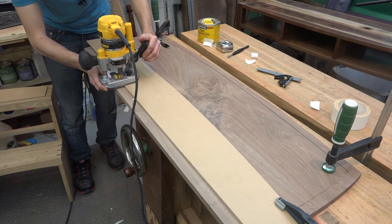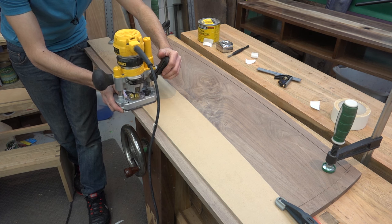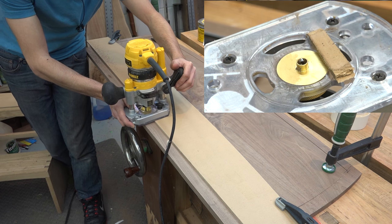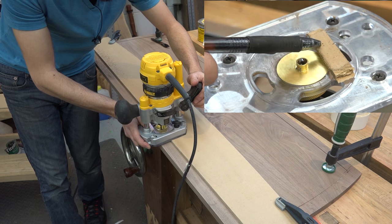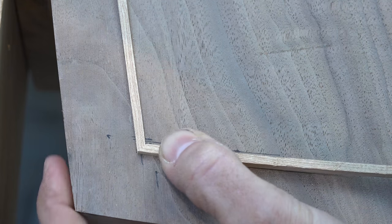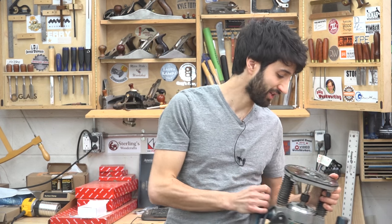And lastly, here's the technique that brought about Russell's question. In this example, I'm creating the grooves for an eighth inch wide perimeter inlay. I'm using an eighth inch diameter bit with the guide bushing riding against a curved template. In this case, the guide bushing was necessary because you can't get a pattern bit that is only an eighth of an inch wide. I hope these few examples inspire you to find some creative way to use guide bushings in your shop — they really make the router an even more versatile tool.